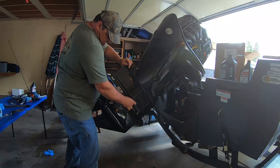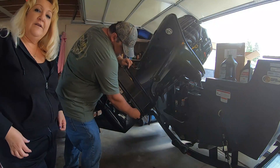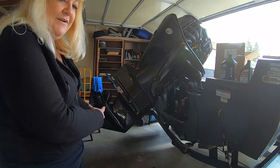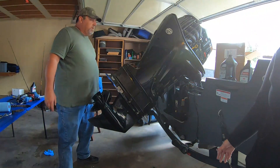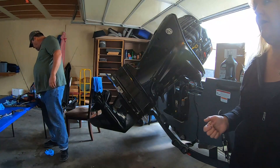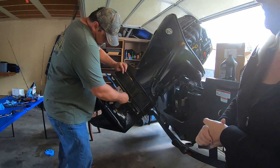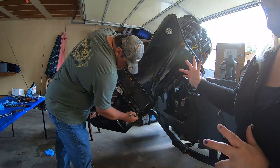I think all together it took us maybe about 20 to 25 minutes, so it really wasn't very hard to do. The hardest part is taking the lower unit apart from the motor and carefully getting the drive shaft off. Just don't forget how you put your parts on and off — keep looking at the old parts. It's important to know which way your gasket faces up or down. Make sure everything's matching before you put the seals in. A little bit of grease on the drive shaft and you put it right back in — it's actually pretty simple and pretty easy.